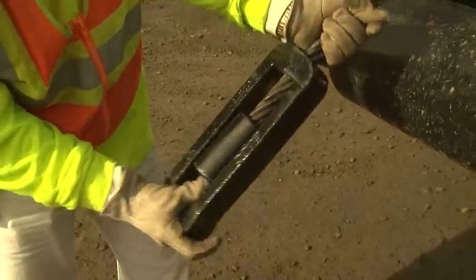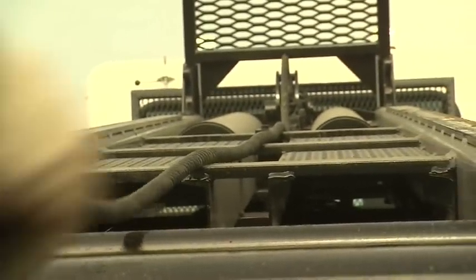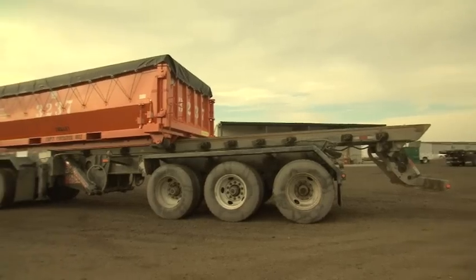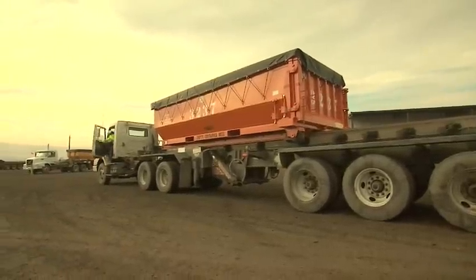The thimble at the D-ring should also be inspected to verify a secure connection. Check the condition of the D-ring for physical damage or compromise to the structural integrity. If the shuttle truck is loaded, verify cable tightness and that the secondary safety pin is actuated.